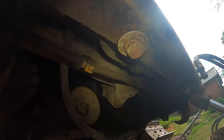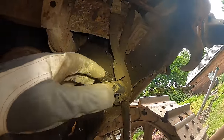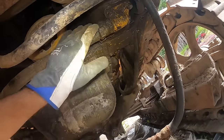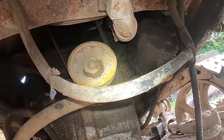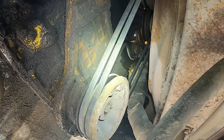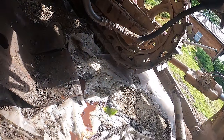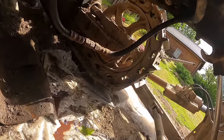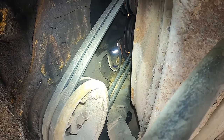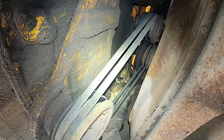Oh, never mind, that's just some stupid hydraulic leak. Not important. And the engine is green. Got some green here. Obviously somewhere from here, but visually I can't see anything dripping. Well, considering the fact that the water pump should be right there and the pool is right under the water pump, then it just might be a water pump seal. But I can't confirm that right now, because currently it's not leaking, so...